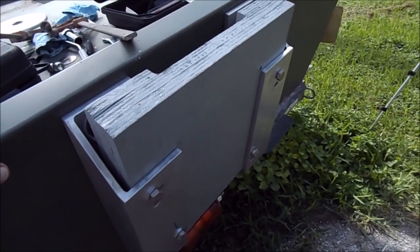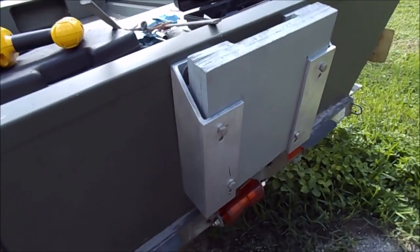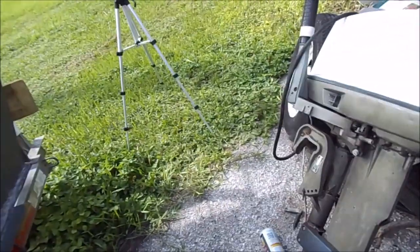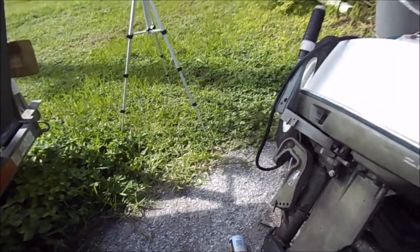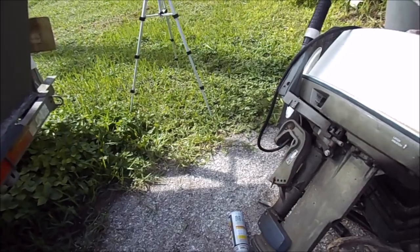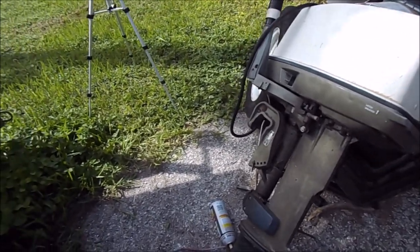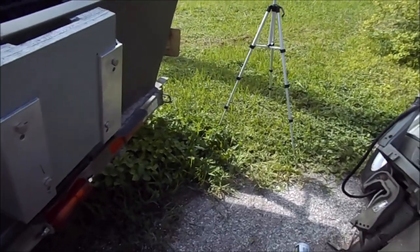It's on there. I'm going to need three more three-and-a-half inch bolts - three inch just isn't quite enough to get the locking nuts on there, and I'd like flat washers too. If that doesn't work I can always drop it down and move the whole thing down. The rule of thumb is every inch you go back is an inch you can raise it. Since I was three and a half inches from the bottom of the boat to my cavitation plate, this should be about right running level with the back.